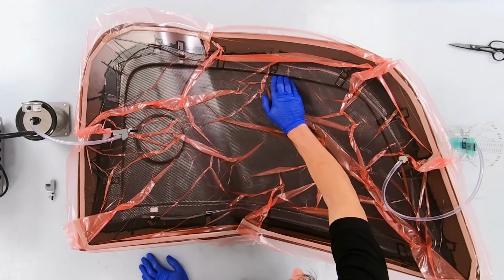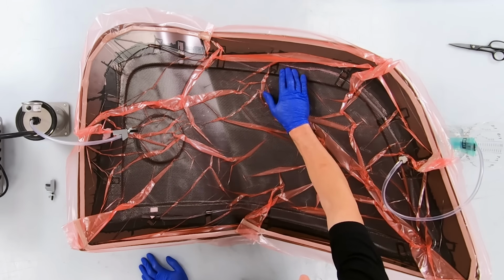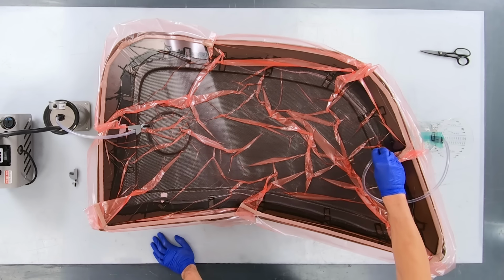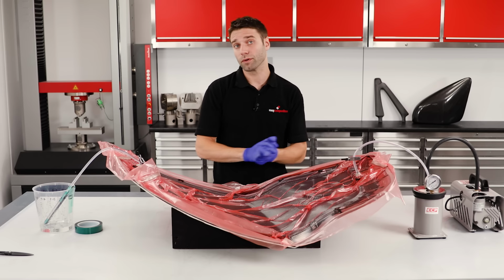As the vacuum bag is still under elastic tension at the moment over the mesh, the part will continue to draw in resin for a few minutes after the vacuum is clamped. I will typically allow 1 to 5 minutes of extra time for the resin to draw through, which, for some slightly complex reasons, tends to improve the surface finish of the part with almost no impact on its weight. Now that the inlet flow has significantly slowed, it can be firmly clamped and the part can now be left to cure at room temperature.